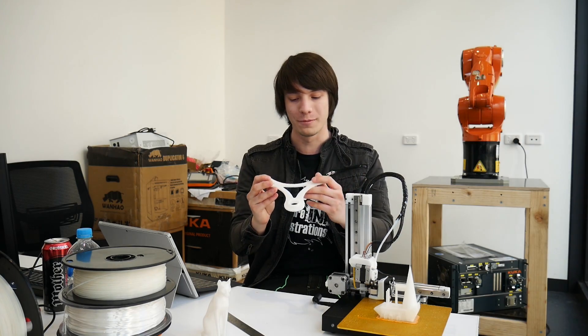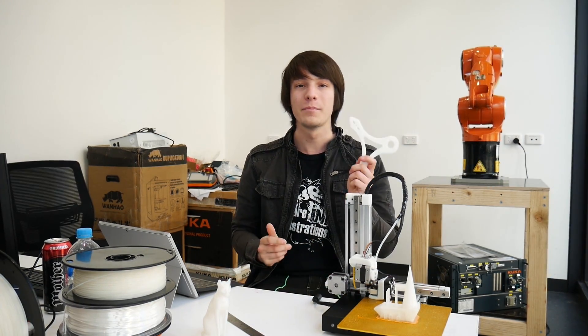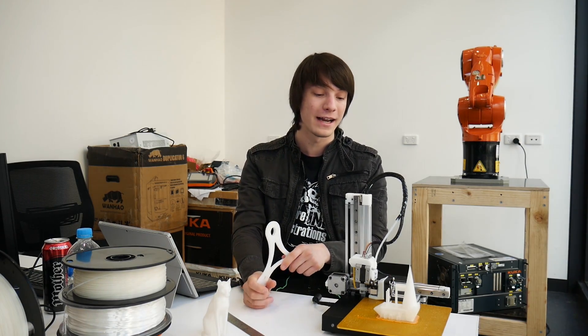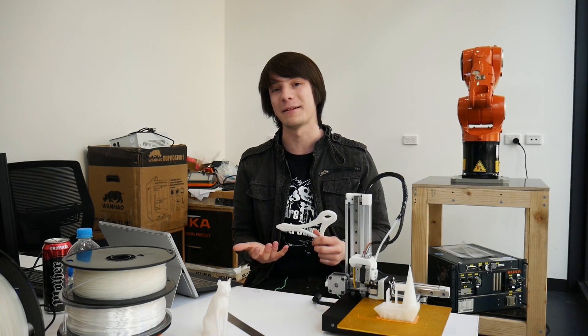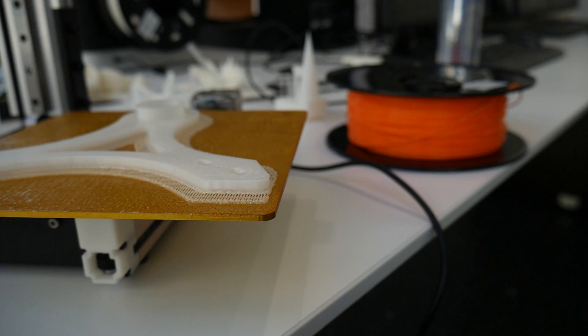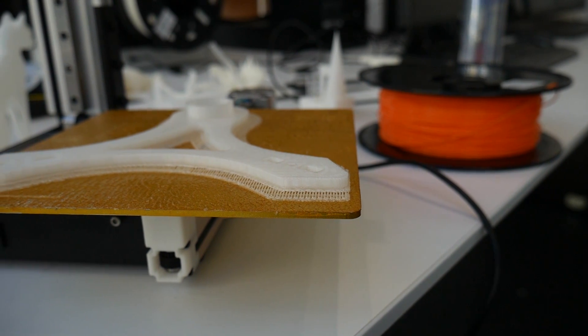This print is almost the full size of the bed in PLA plastic, and there is a tiny amount of warping — nothing serious, nothing that most people would notice, but PLA can warp. On a non-heated bed you can still get warping with PLA plastic, so you may need to run the software bed levelling compensation to get your settings dialled in.